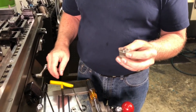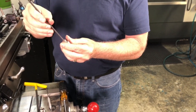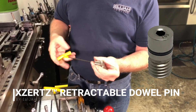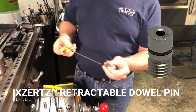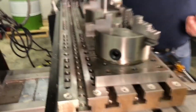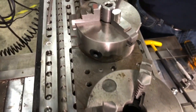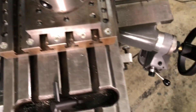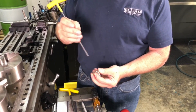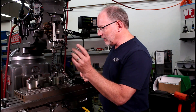The way this works — it's a really simple product — we've got two of our Zerts, retractable dowel pins, that work together in it. You can see the bottom. We just screw this down and it's going to locate in these little divots that are in the fixture. The divots are precisely made and precisely found on one-inch centers. It'll locate in the divot, and then we use this Zert on top which will locate at the same location as the divot.